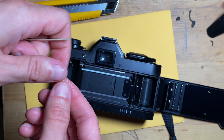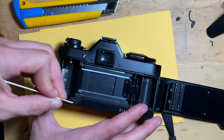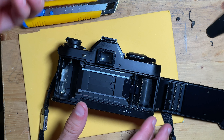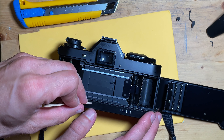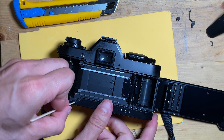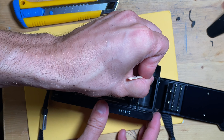Every once in a while you might break one of these sticks — that's fine, there's a whole bag of them. Don't be afraid to break them; use new ones as needed, keep them clean. Just keep scraping away. Try to keep the gasket debris away from the shutter area. You could put a piece of masking tape over the shutter mechanism to keep gunk from going in there — I probably should have done that but didn't, so just be extra careful. Learn from my mistakes.